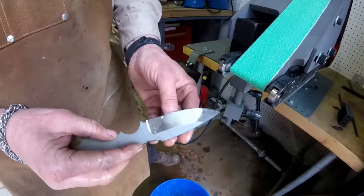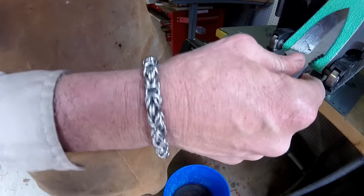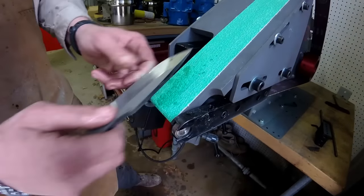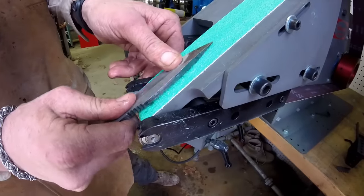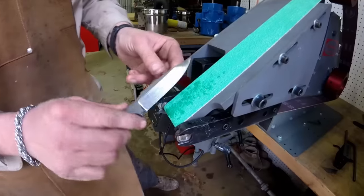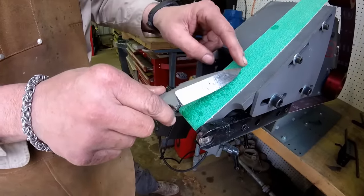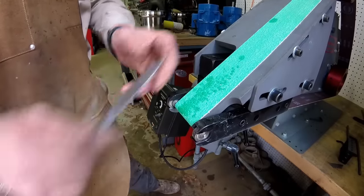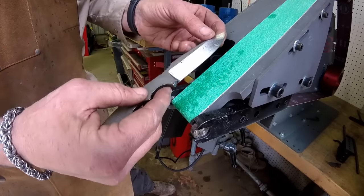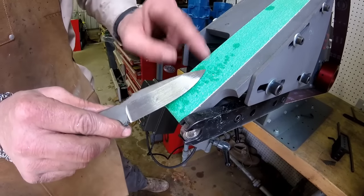This is how the plunge attachment works. The last thing I haven't done yet is take the scratches all the way to the tip — that part's a little tricky, because I'm actually going to physically have to rock the knife. You have to make sure when you do it, it stays on its flat, or you can hand sand it. I'm going to attempt to rock the knife — I'm going to have to put pressure right here and just try to rock it on the flat part. It's tricky; you have to make sure you don't go too heavy on the tip or you'll actually bury it into the belt and it can be projected at you. As you can see I've got the plunges almost even, and if I found one were further forward I could push it to the rear.